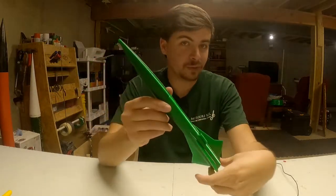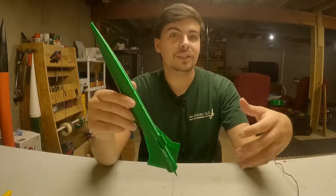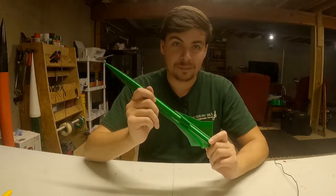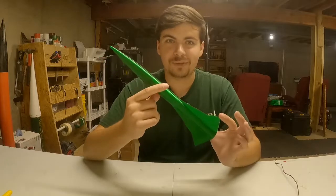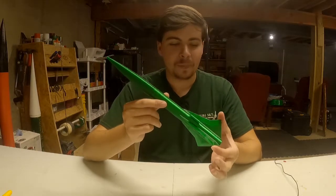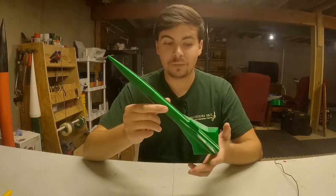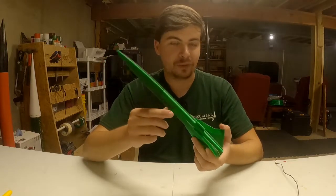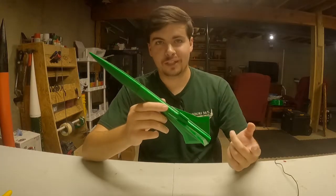Because this vehicle is 3D printed, I knew the CG was not going to be correct no matter what I did, so I was just looking to get the center of pressure based off the model itself. Then I printed my first prototype — this is actually one of the production ones used for my build guide, but same concept. Once I got to the production version, I had a great idea of what it was going to be, but I didn't have the CG correct yet, because with 3D printing you can model it but it's not accurate until you weigh it and check it.